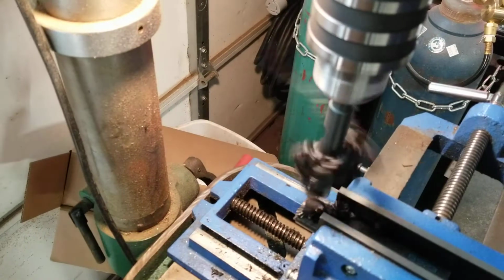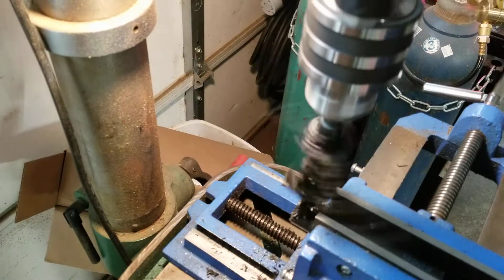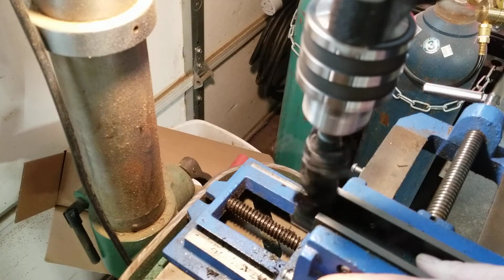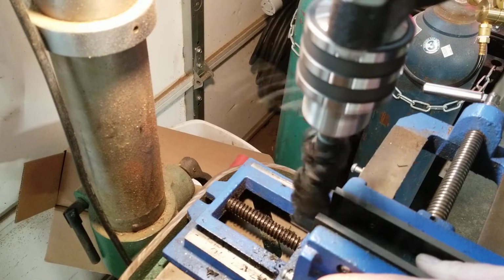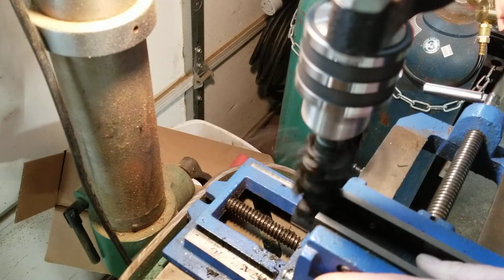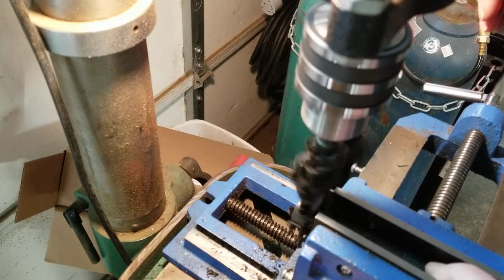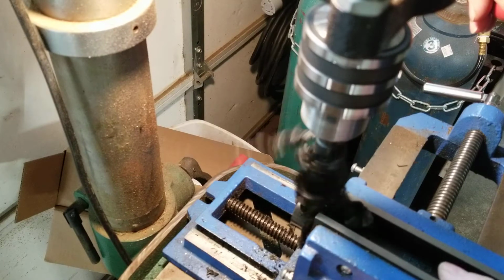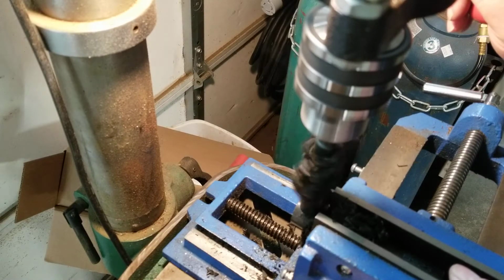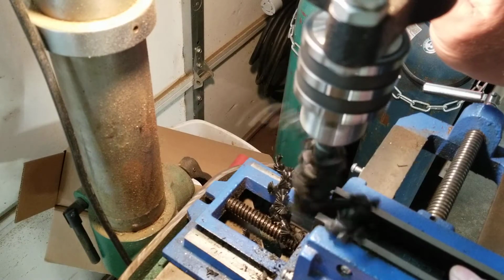You see this stuff? I'm not touching the drill. Even though it's plastic, it created a lot of force the last time, and I didn't have one of these bolts on the horizontal vertical shut real tight, and it actually slung the vise over to the side. So if you're cutting this stuff, just don't generate heat in it, or it binds. Just take your time through it.